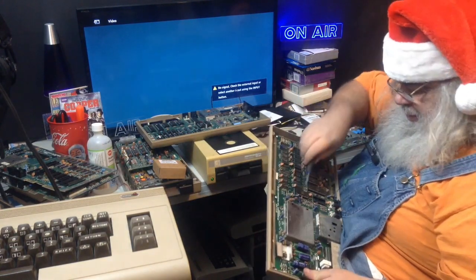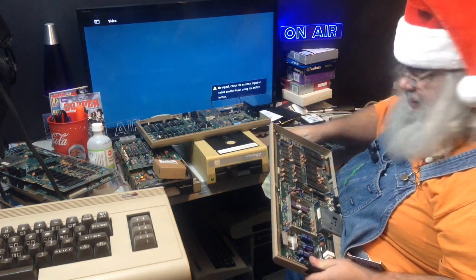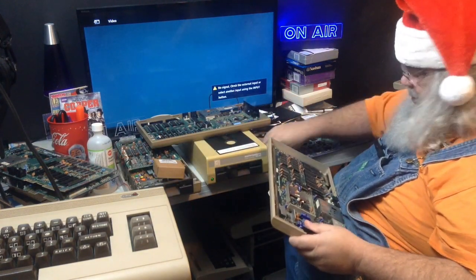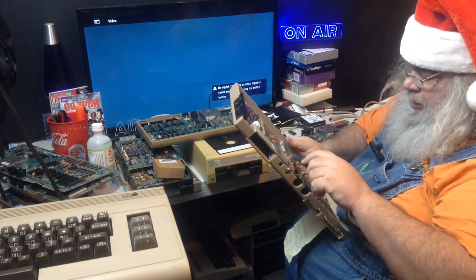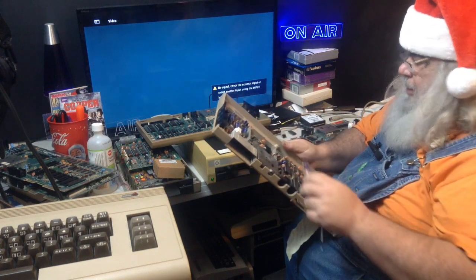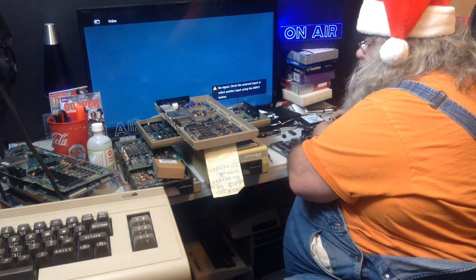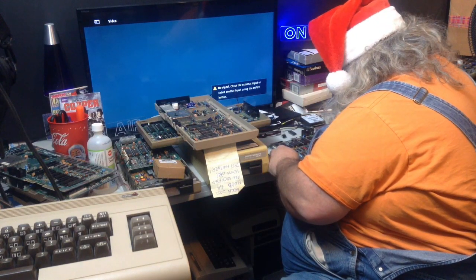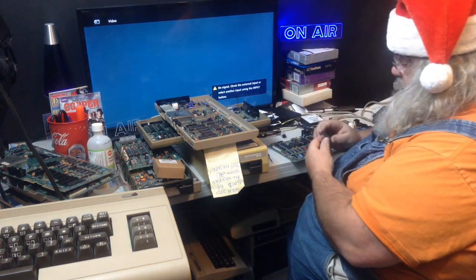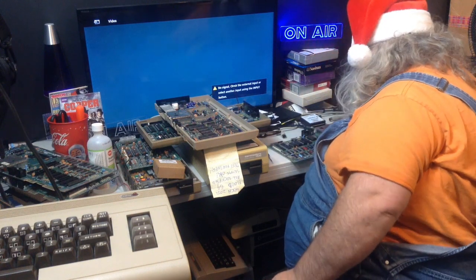That. Oh my word. This is really tight. I don't know if I've ever had quite this difficulty. Oh! Look at that. It's off. Okay. Gently, with great care, put that down. Okay. So, I will, oh yeah, that's kind of nice, very gently take that out of there. Checking the witness mark. I will put it in. This is the PLA chip, which should be U17, which it says on the board. And I will put it in.